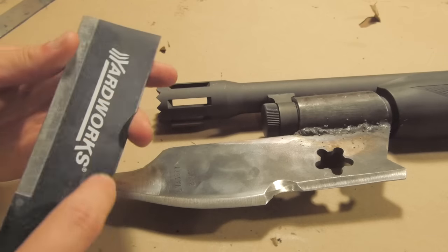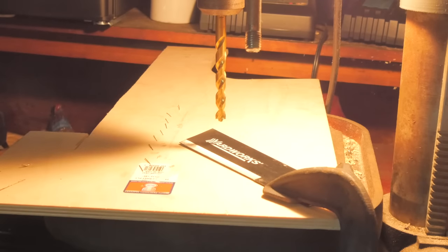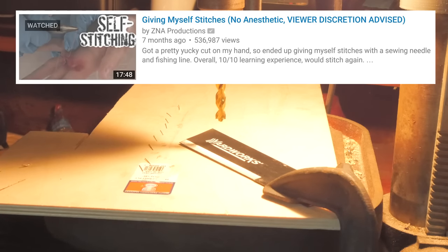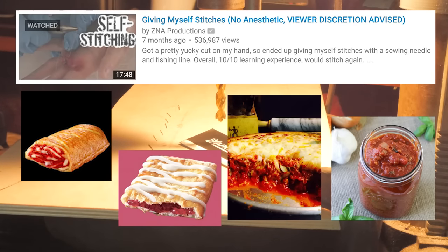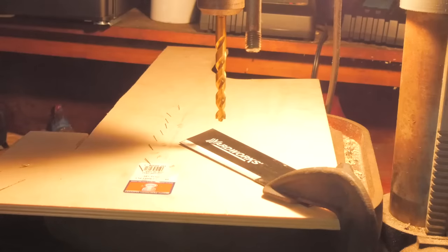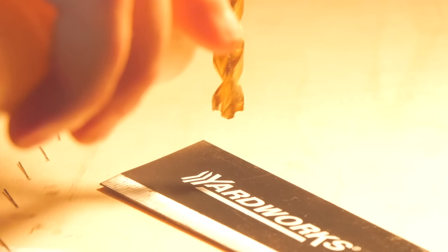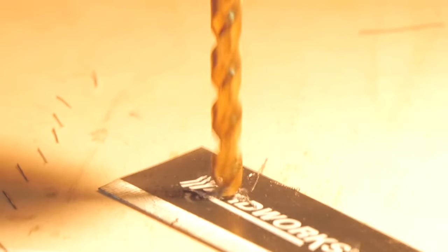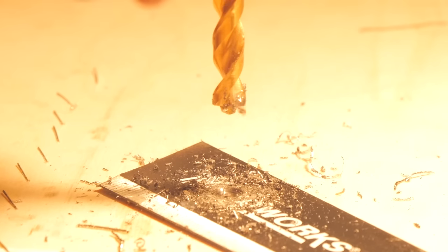So that's fitting super good. Now we're going to drill our first hole into the machete blade. For the love of gosh, if you're using a drill press, make sure you clamp down your work piece — go check out my self-stitching video if you want to know why. Maybe grab a hot pocket, a toaster strudel, some lasagna, a cup of spaghetti sauce to wash it down — get ready for a very relaxing experience. This is some hardened steel so make sure you use a liberal amount of oil. A little more oil. I suddenly remember why I hate drilling through hardened steel.